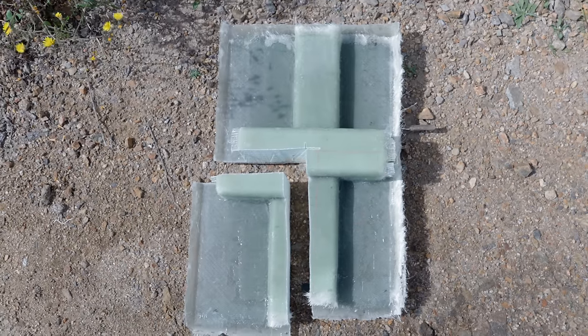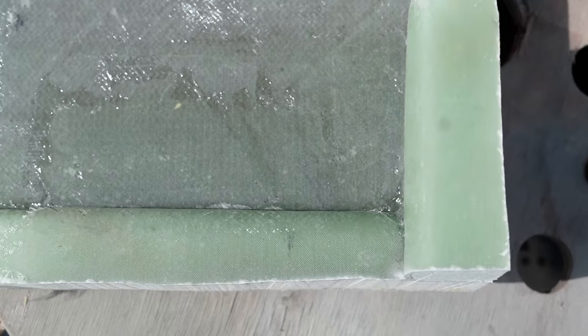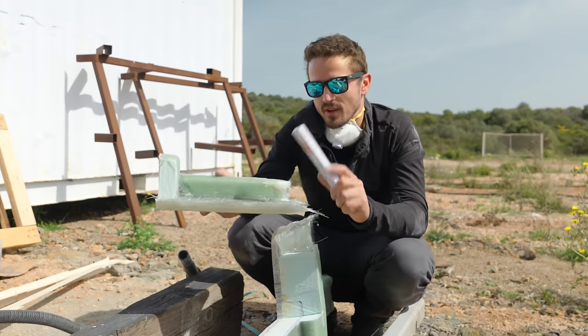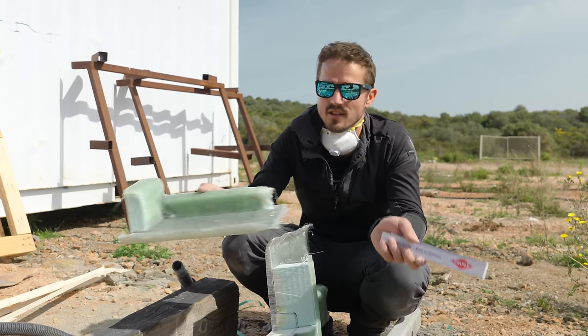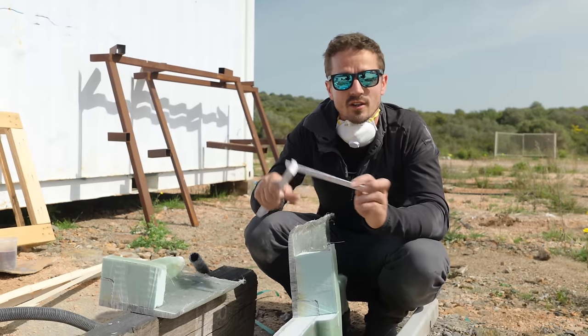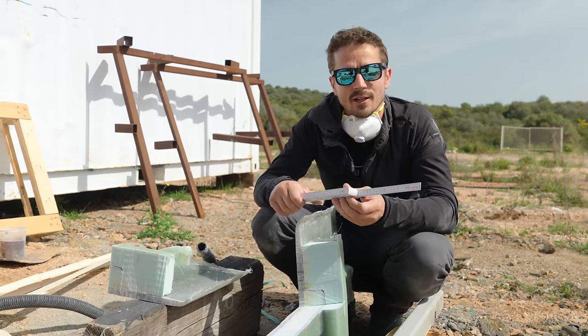This entire hull section is also gonna get two more layers of 650 biaxial on it. And then it's gonna fill in this corner a little bit more. So we've got a 2 mil brand new hull built on the inside of our old hull. And then these ribs and the stringer are just gonna stiffen up the entire boat significantly. It's insanely overkill for a cruising boat, but where we're going, we're gonna need it.